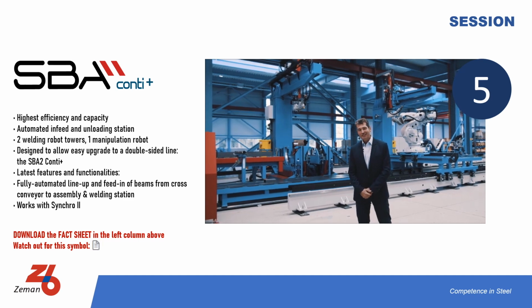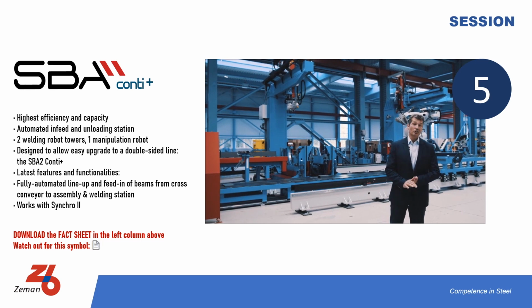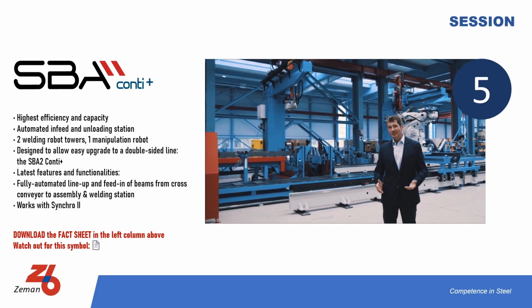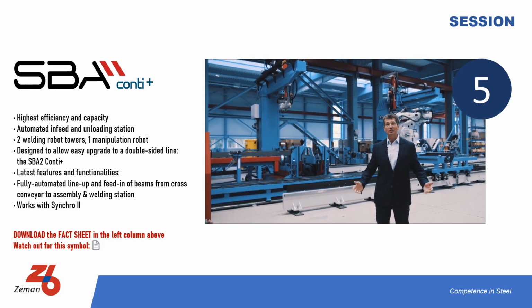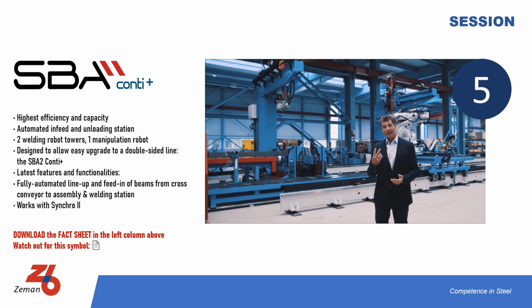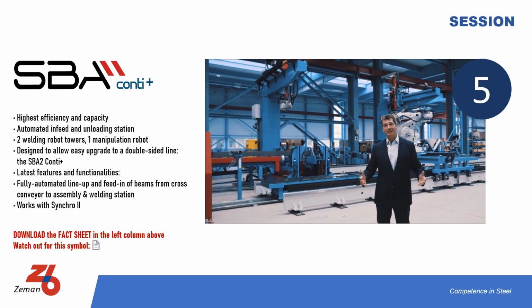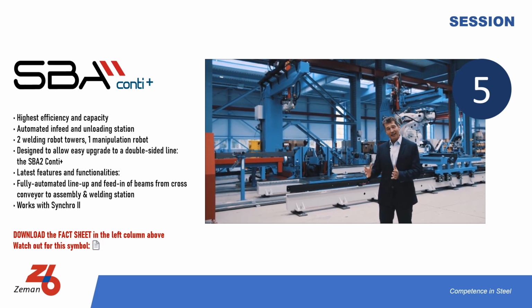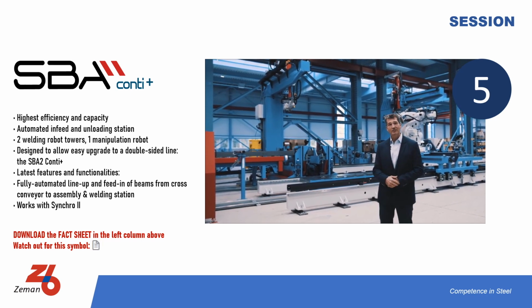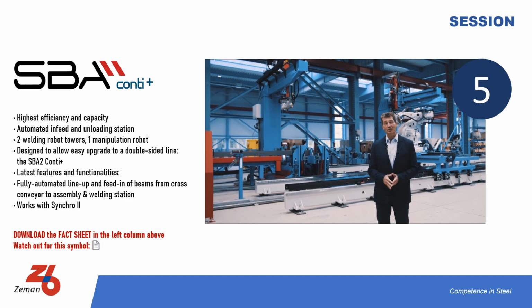Hi folks again, welcome to the webinar. Next session, this is our SBA Conti Plus, our biggest machine, luxury machine, the powerhorse of Zeman company. So what you see here is a machine having two welding robots, and this machine is designed for 18 meter long beams. We have a cross conveyor fully automatically aligning the beams parallel for the infeed, and then we have the assembly and the welding station and the unloading station, which makes the Conti Plus.